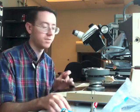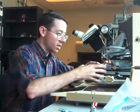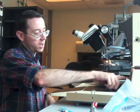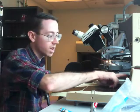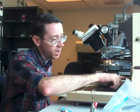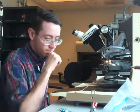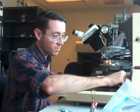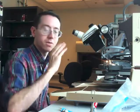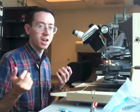Once I've done that, I'm going to move to the base here, under the pad, and the needle. You'll have some dials here — on this one you have force, time, and power. Force I don't mess with much. Time I actually like to mess with a bit. Power is the one I mess with the most. Usually it's just a little bit of adjustment either way as you're going along. Once you get dialed in, you'll just need a little bit of adjustment as you go from pad to pad.